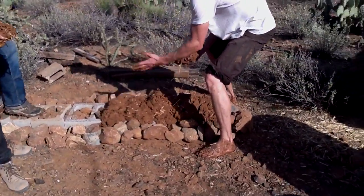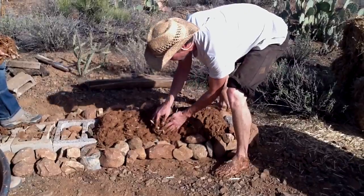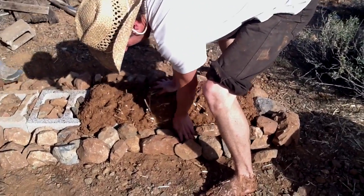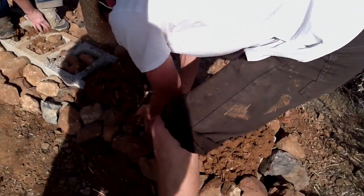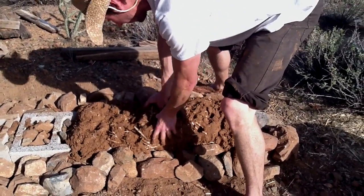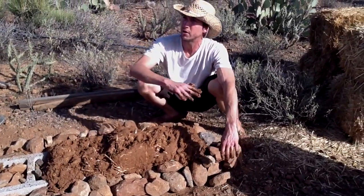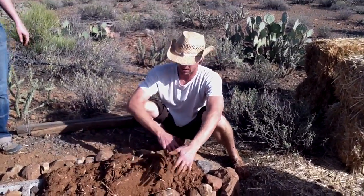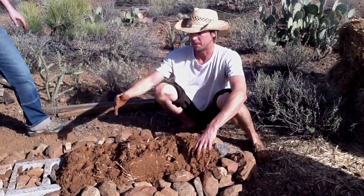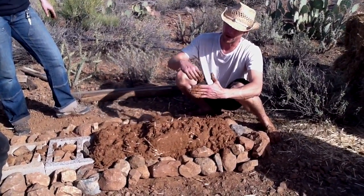Two common mistakes: people build in like a pyramid or out like an upside-down pyramid. To keep the wall straight, push down on the edge and key in with one hand while the other hand pushes down and slides to give you your form — you can just eyeball a nice straight plumb wall. Always build level: do a course, then another course. Don't build up one section and then key in the other. At the end of the day you don't want a funny mound — leave your cob flat so the next day you're not building on an angle.